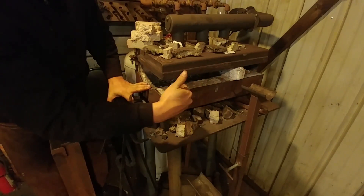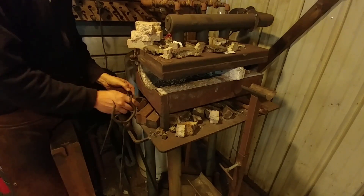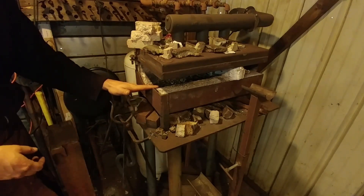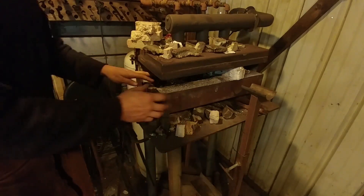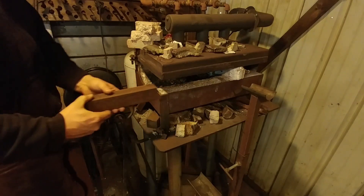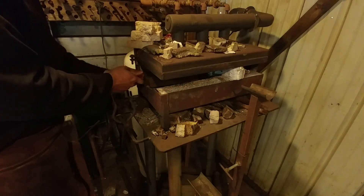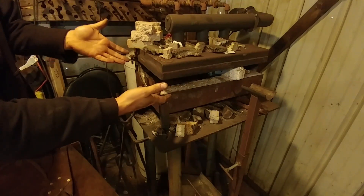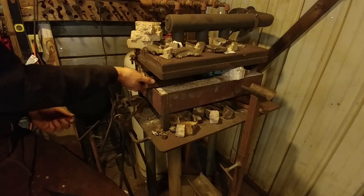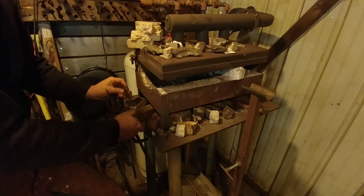It has the ability to have a divider so I can make the heating compartment smaller and only use one of the three burners if I'd like, or just two. Most common gas forges nowadays have at least two burners — that's just a popularized styling. One of the advantages of a gas forge is that you can take a large billet of steel, set it in the gas forge along with its twin, walk away, and 45 minutes to an hour later these things are ready to go — you can work multiple billets at one time. This is my go-to whenever I have a lot of production work to do.